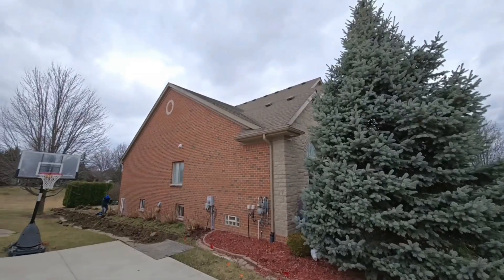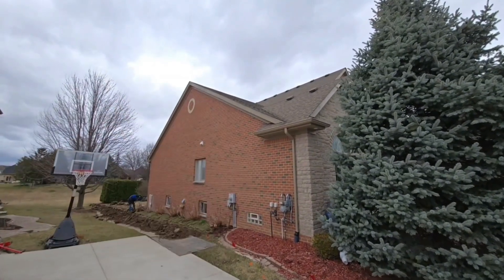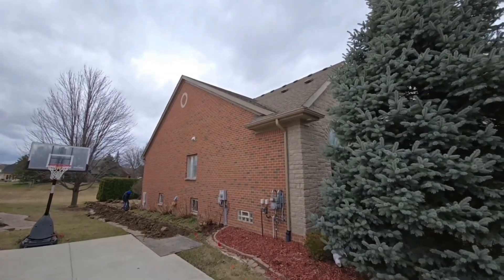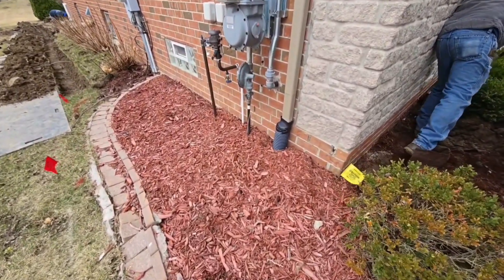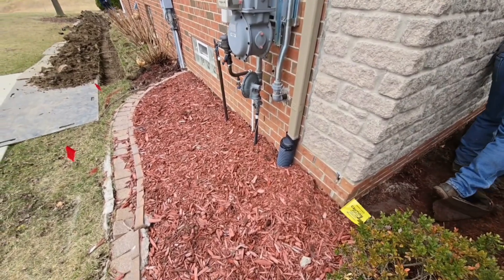So you see all that water coming off the roof — we have roof water coming down in this valley, and there's not very much gutter catching it. You have to pay attention to that. We know this gutter is responsible for a lot of water. So this 2x3, during hard rains, could be running pretty much maxed out.